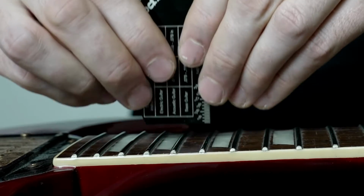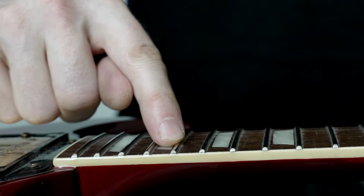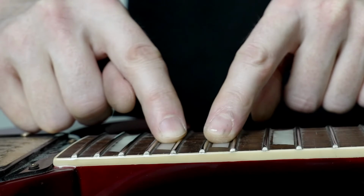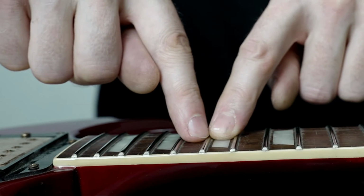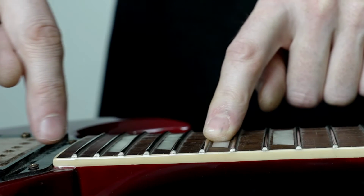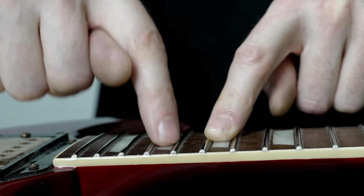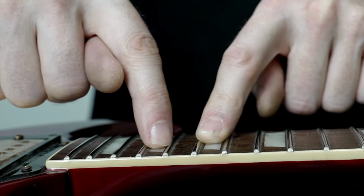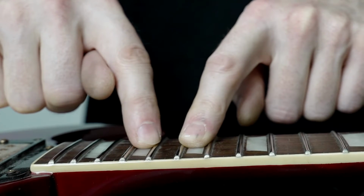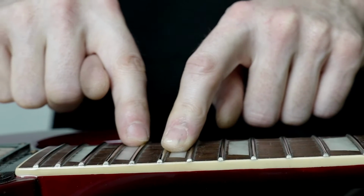when it's this high, can cause, for example, a dead tone on fret 17. When you bend up here and the string is touching the 17th fret and is then going downwards to the bridge, and it doesn't have enough space here, and it touches the 18th fret, then the tone buzzes, is squealing annoyingly, or it's completely dying off.